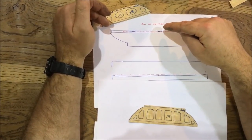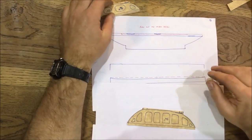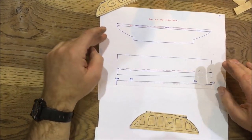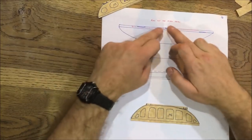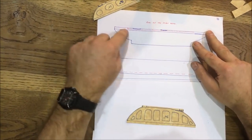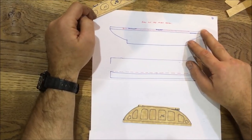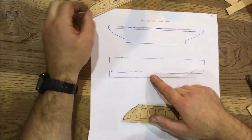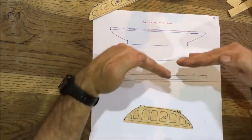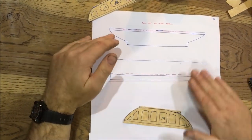And that led to me, okay, several things were tossed across the workshop, let's just say. The next approach was having got it to a reasonable plane, and I certainly didn't remove all of the pitting, but I got probably 70% of it out. I then went back to basics and dropped the middle down by a thou, and then brought the ends down, or at least that was the plan.